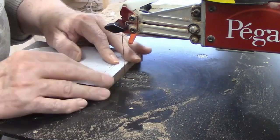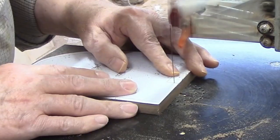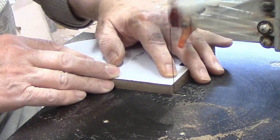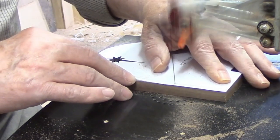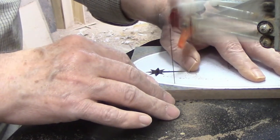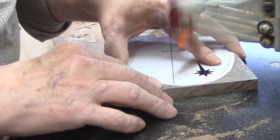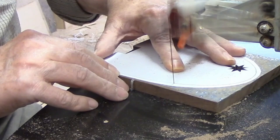The half circle cut for the front of the bottom was a piece of cake. For the back I started by cutting across the board, then cut each side of the slot first. When I got to the intersection for the right side of the slot, I backed off slightly on the blade, pivoted the workpiece 90 degrees, and made the cut for the length of the slot. From there I moved on to the outside cut for the oval shaped back — just following a line around from one side of the board to the other. I was careful to keep my fingers to the side of the blade at the end. The scroll saw is safe if used properly, but it will cut you as well as wood if your concentration wanders.